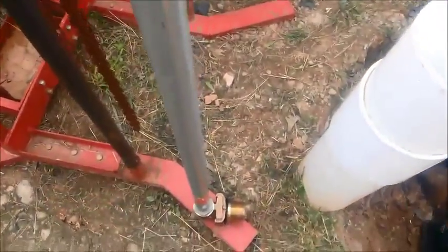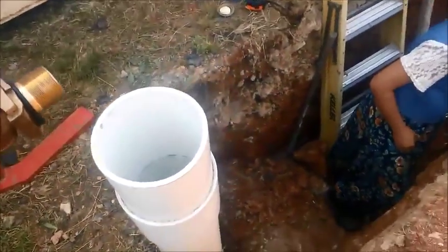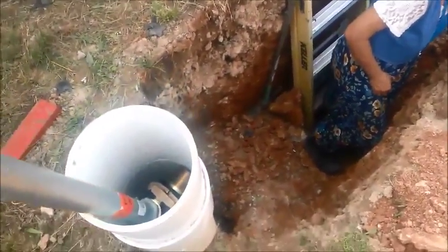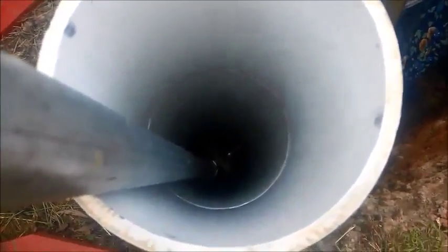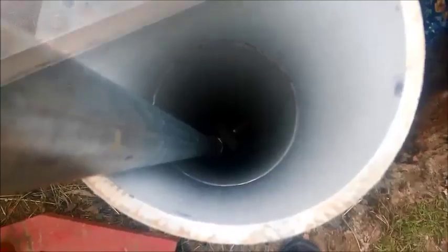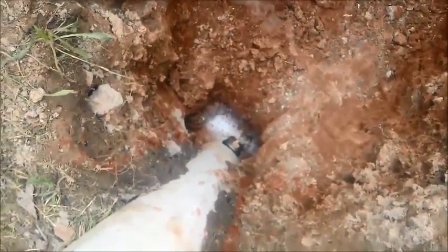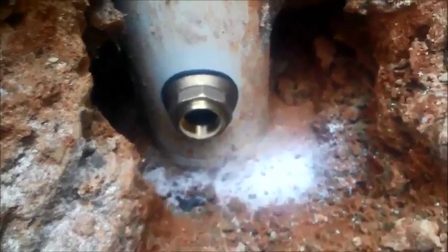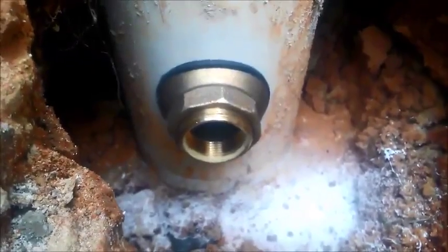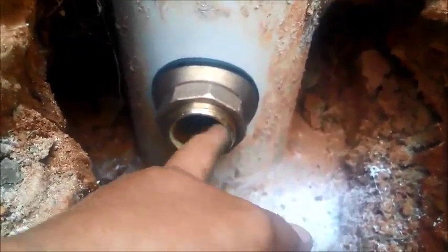Here's what it looks like with the pitless adapter inside part on the bottom of the T-post lift pipe. I'll pick it up, set it inside, and give it a little angle to maintain adequate pressure. We've just installed the pitless adapter - the T-post is still in there secured to the inside part. Outside, you can see where we tighten the rubber gasket, backing plate, and lock nut. The T-post remains in place as leverage while we install the outlet pipe and connect it to the one-and-a-quarter-inch threads.